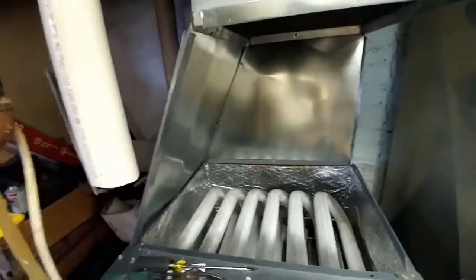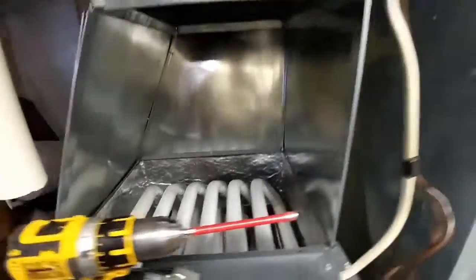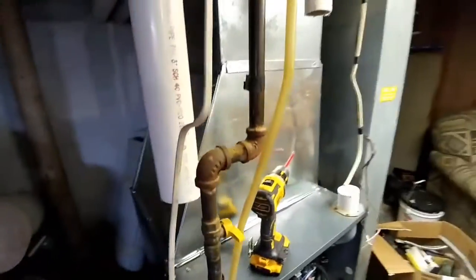The front and back are going to have one inch bends on them and go into the sides with vertical S-slips. Here's the left side going into the back. I added the S-slips as I went. There's the right side and finally the front. S-slips on top, S-slips on the corners and the sides, DFO on the bottom. One solid plenum.